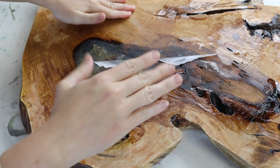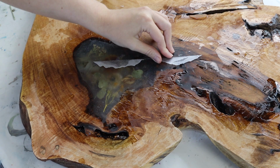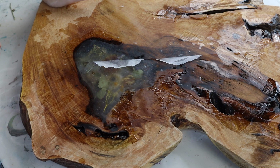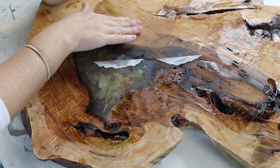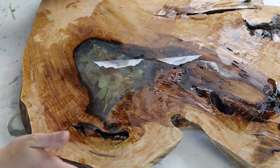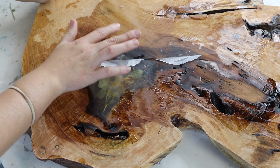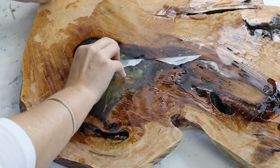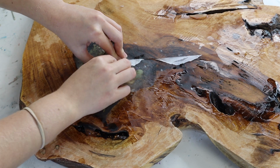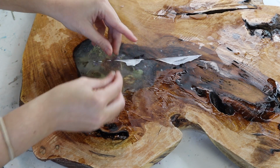But because this bottom wasn't level to start with, if I had leveled it, I probably would have had it a lot more even right now. But all I'm going to do is sand it back and get a nice flat even surface. As you can see, it's got ridges and stuff like that, but this piece wasn't given to me level, it's just an old cut off, so you've got to make do with what you've got. But yeah, I think it looks pretty good, and it's a pretty easy technique and a little trick, just to use some baking paper instead of building a proper melamine slab.